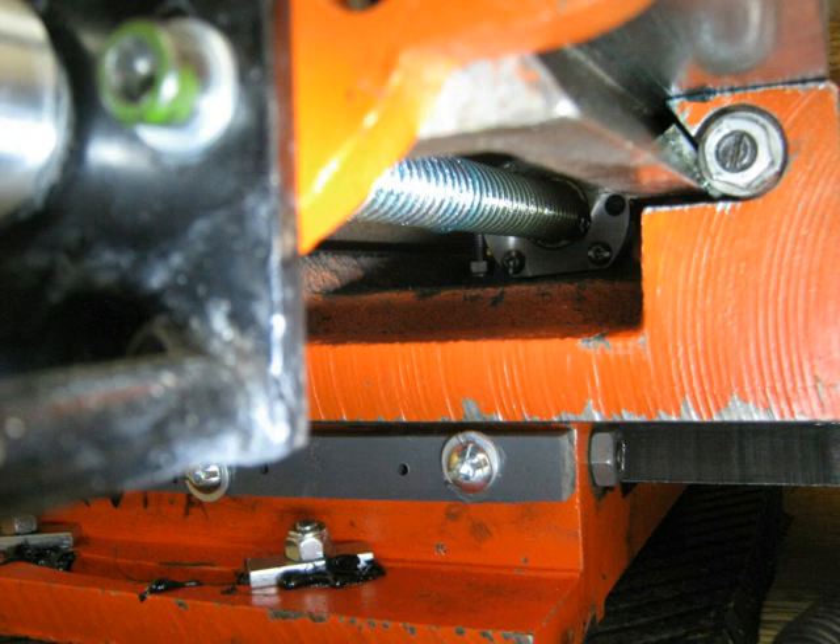Let's see how to grease a ball screw nut of a CNC machine. If your CNC machine is making a very high-pitched noise as it is moving, you need to apply grease.